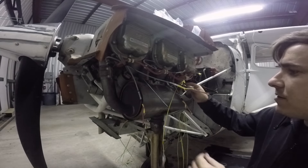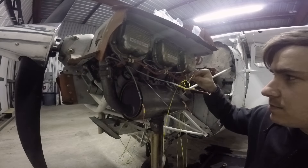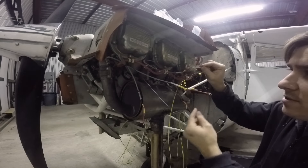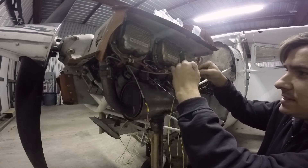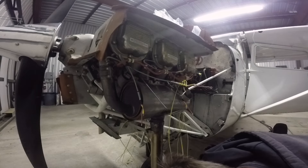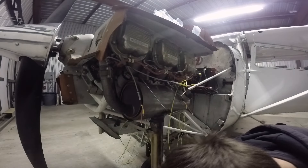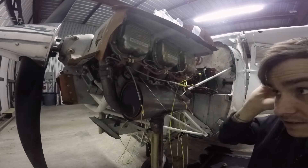Cut that off and get rid of it. Here's number six EGT — what you want to do is strip off the outer yellow insulation, and strip off the inner yellow and the inner red. Stagger them like this, because these are staggered. If you cut them off even at the same length, it's going to be a lot harder to get this together. Once you get that together, you just screw it together with the provided flathead hardware. Then there is a heat shield that goes over the outside and gets zip tied. So that's the first one done.